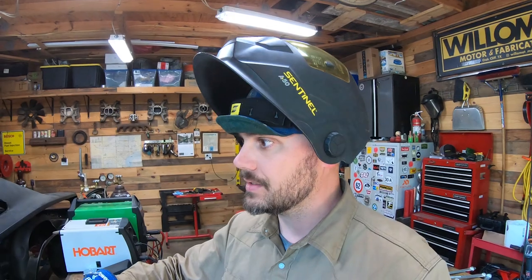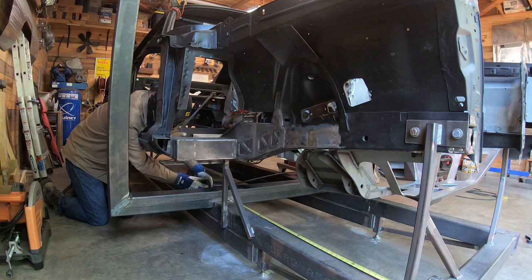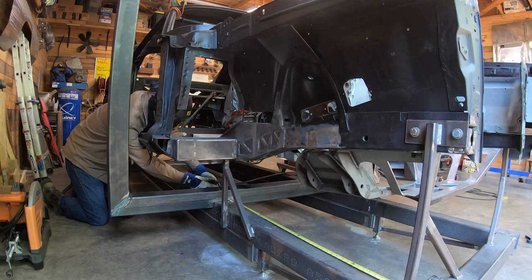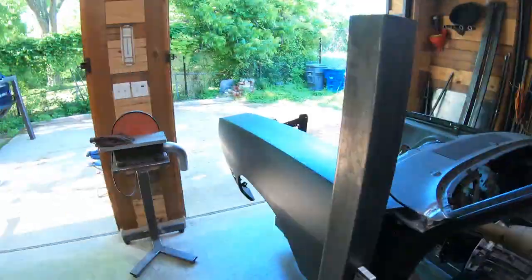Everything that's in the bracing world is not going to be perfectly square, because what you're comparing it to or what you're latching it to are parts and dimensions on the car that need to remain somewhat flexible. So you're going to be trying to bend some of these things out of 90 already just to get it to push and suck into the car. Let me show you maybe a little better way to explain that.